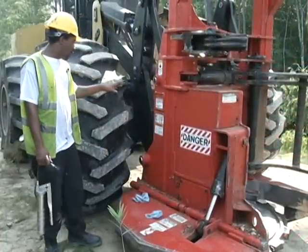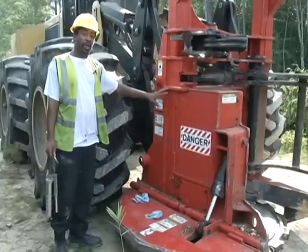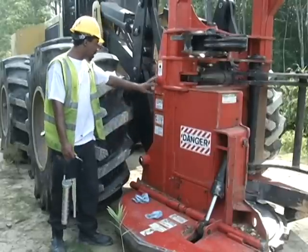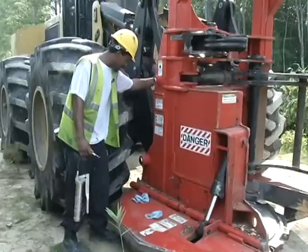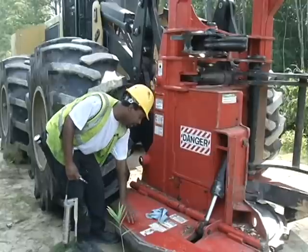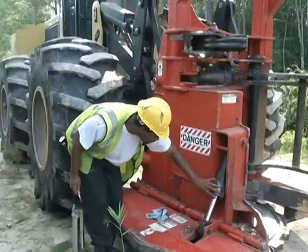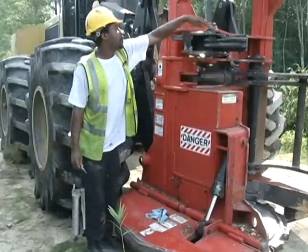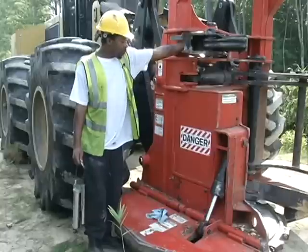Moving on to the head. On this side of the head alone, there are ten fittings. On the head total, there are twenty. So once you get this side knocked out, the other ten will be a breeze. You have one here on the other side — it takes some maneuvering to get to. There's one here for this point, and one for this point also located on the other side. You have one for your plate: one, two, three, and four. Then for the cylinder you have one, two, three, four — and one up here, one here, one on the back of here, and one on the back of here.